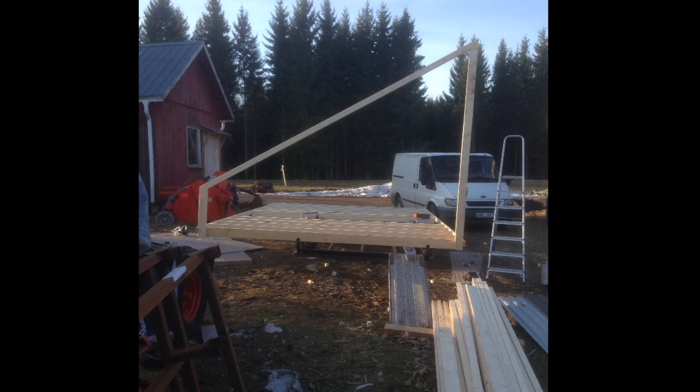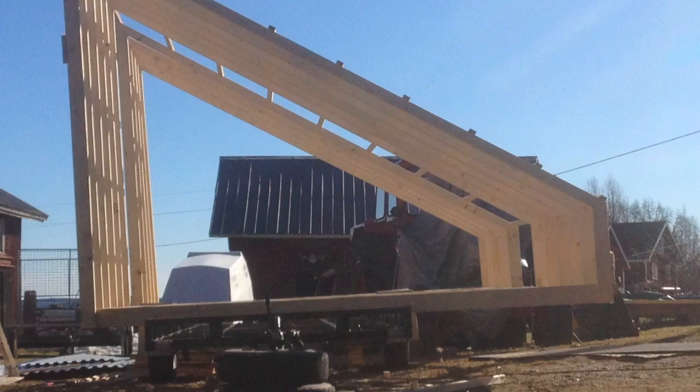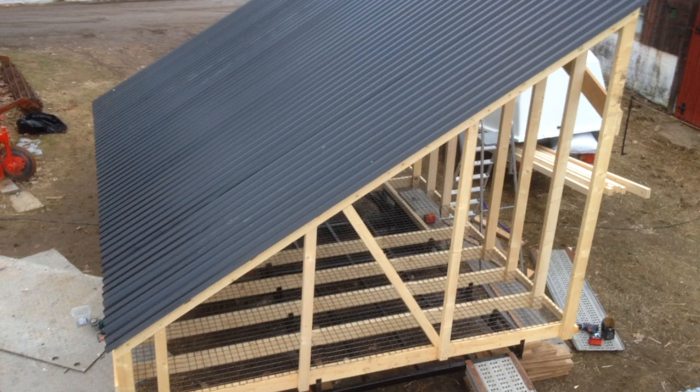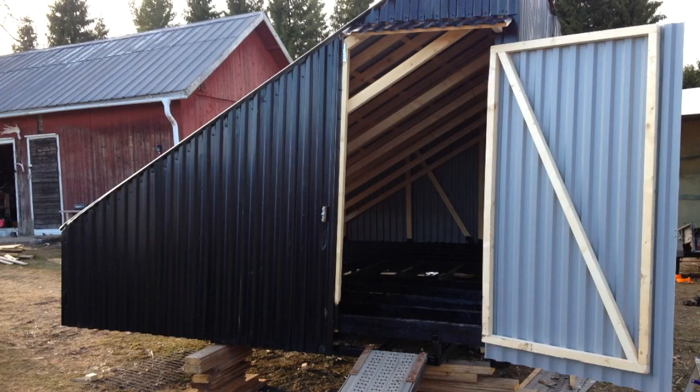You need to account for the amount of roosts and egg boxes you need, and look that up for your regulations. A lot of people always ask me the exact sizes and dimensions, but really you've got to get your roost space down and build it around that. That's part of the reason we have this wedge-shaped roof — so we can park it into the wind; we get very strong winds here occasionally. It's the most efficient way to get that many roosts into a flat horizontal space, so the roosts are actually up in the air. This first Eggmobile uses a lot more timber than the second version, so we'll be copying the second version on the chassis we're working on now. We use metal mesh and fencing pins to hold it down in the floor. Bitumen is a great substance to deal with chicken manure — we've never cleaned out the Eggmobiles; all the poop goes on the floor and it works fine.